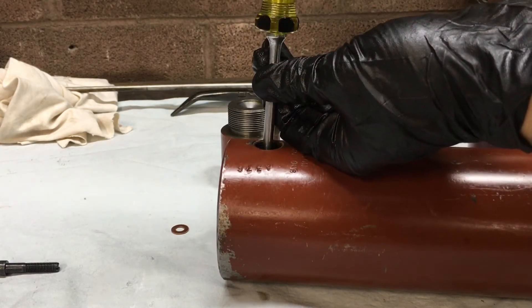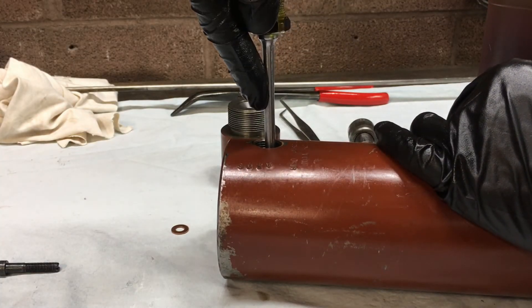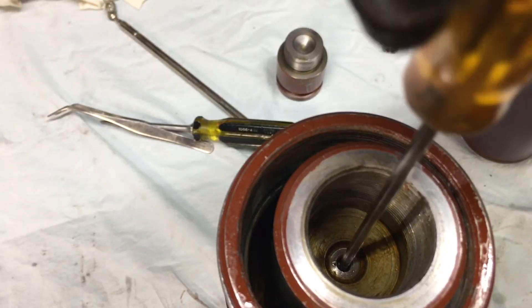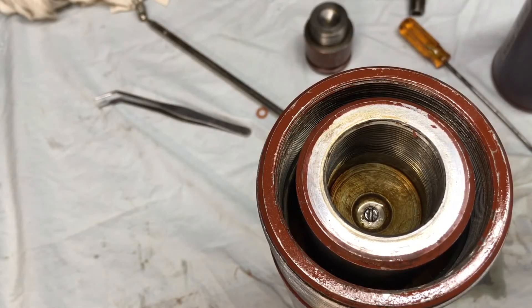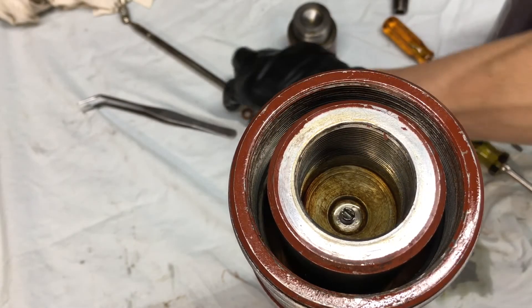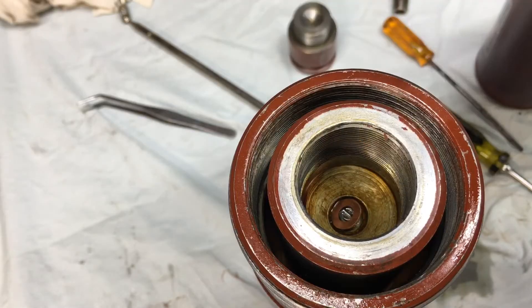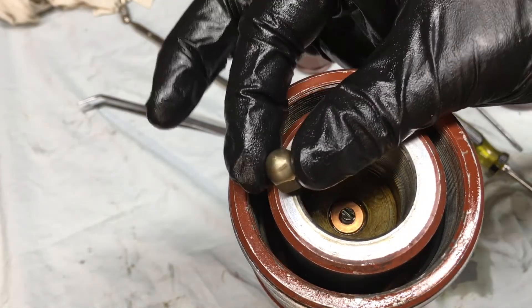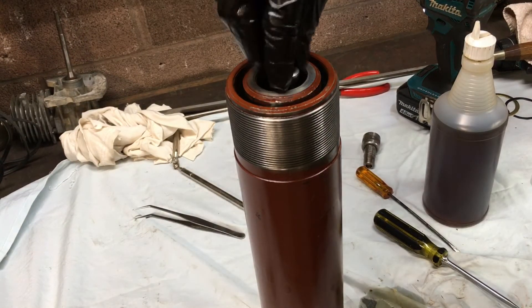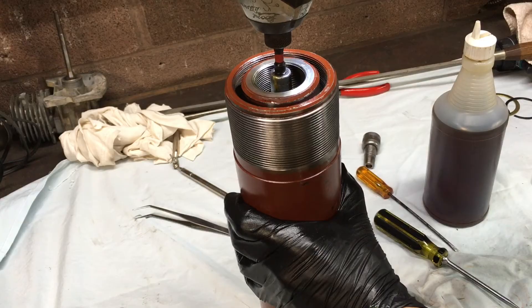With a slight amount of deliberation, drive her home. Notice the flat head on the back of that screw. This will take a little effort as it's tensioning your spring and pulling on those threads. Your end result should look like that — it's sticking up about a quarter inch. It'll take your new copper washer — drop it down on there, take a nut, and use your socket and do this manually because you don't want to strip those threads. Once you've started the thread, just give it a little tap.